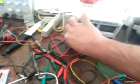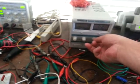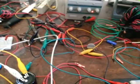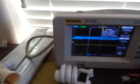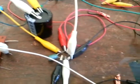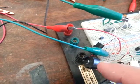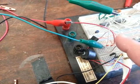So I'll turn this on. It's 2.6 volts. 2.7 volts. And no current because it's not going. If I tap the resistor, the scope probe detects that that's a high going signal, and that's on DC bias, and the DC is connected to this common ground. So that's on the input side of this. This is the coil top.